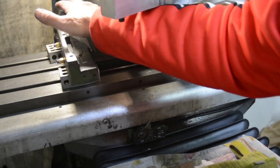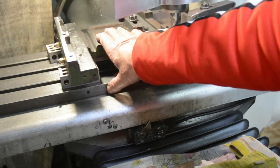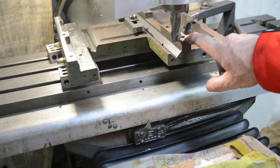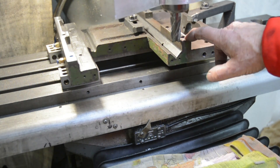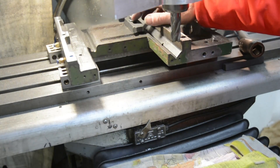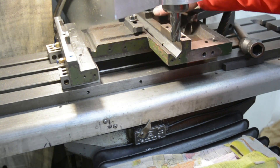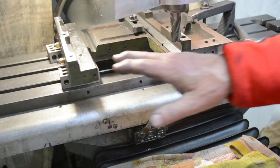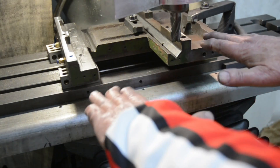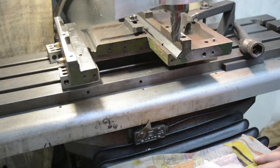What I found was very, very true to the orientation of the top of the saddle. However on this side, this end was a little bit low compared to here, and at the far end this was quite a bit high — so this would not have been a very good reference. Now that it's been machined down, all of these surfaces will be coplanar and give a good reference for machining on the other side.